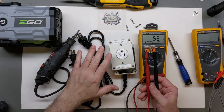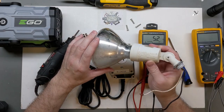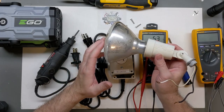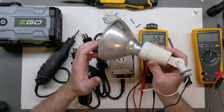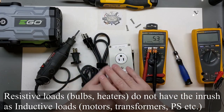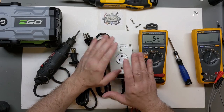Will it work with every load? No. Will it help with any resistive load? No. I have a 150-watt halogen floodlight that actually pulls over 150 watts — this Nexus will not run it. I could run a 60-watt or 75-watt bulb fine, but this 150-watt pulls about 165 watts and will not start. Similarly, if an inductive load pulls too much inrush, the NTC can't knock enough off. For a resistive load like a light bulb or heater, if it's just too much it's going to be too much — and even if it did let you start, once the resistance drops it would become too much anyway.